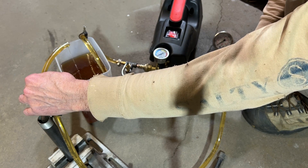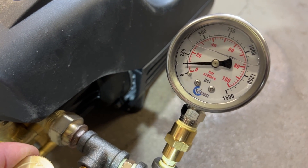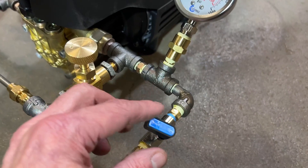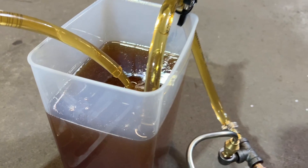You can see there it's very small flow now. We can shut it off all the way, and this thing can do an extreme amount of pressure. As we close this valve, that pressure increases. What we're doing is we're creating a high pressure zone in this region. If I open the flow valve, it's going to drop. You can see now it's really coming out of there.